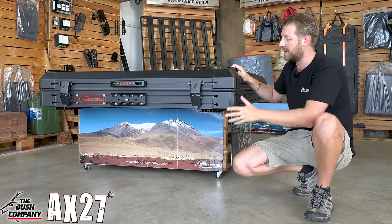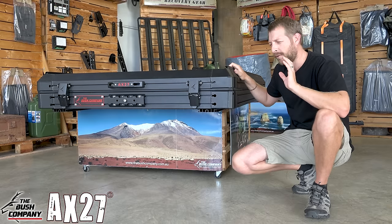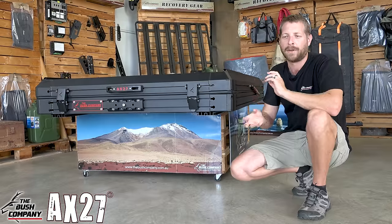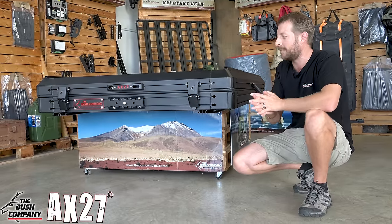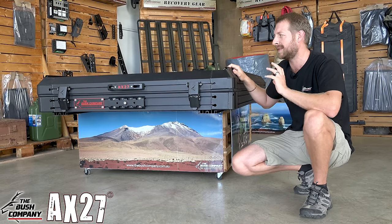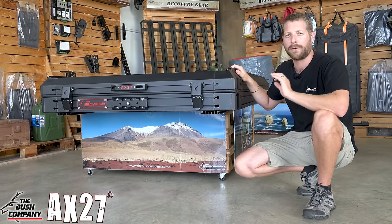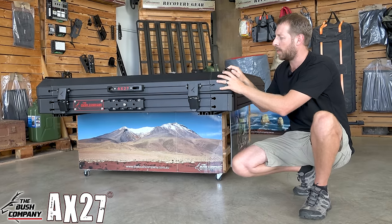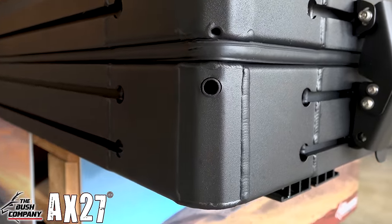Now, as far as the frame itself goes, the frame is made from an extruded alloy, and the great thing about extrusions and playing with extruded alloys is the ability to mix your different steels or aluminiums or whatever your metals might be, to give you the ultimate in tank style strength and still elasticity in the material. So one, you can save weight, but you can also get the strength right up there, and that's what we've done. With these, we've got a double skinned corner section as well, which has the slot receivers for your bolts to slide in.